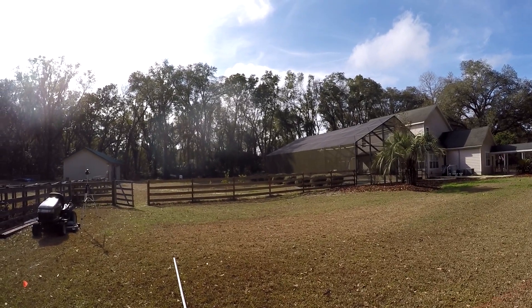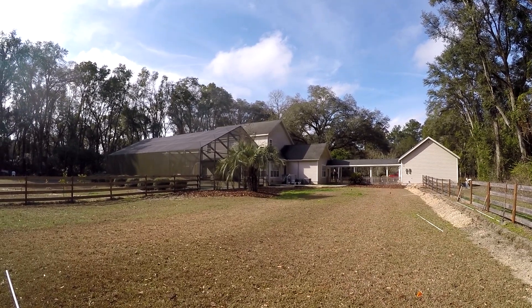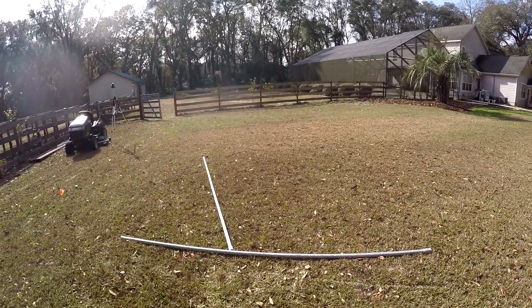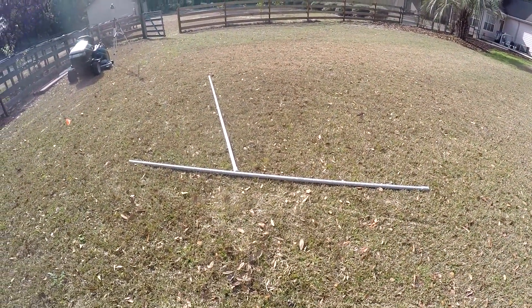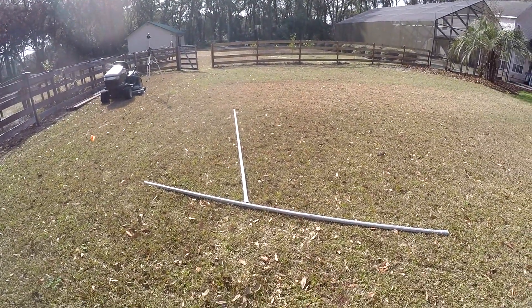The more south you go, the more power you get. The more I angle it to the west, the more power I'll get in the evening. So it's a little bit of a compromise, and I'm going to be probably 25 to 30 degrees off of due south. All right, let's measure this thing up.